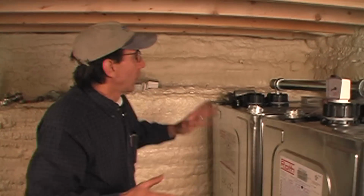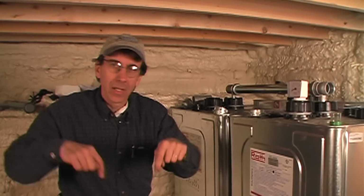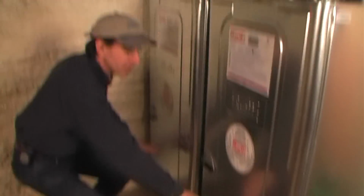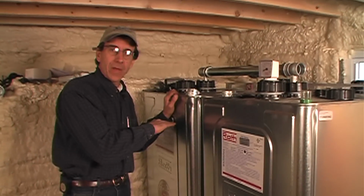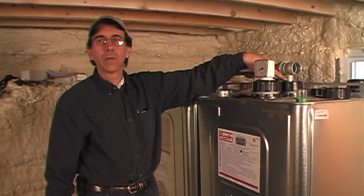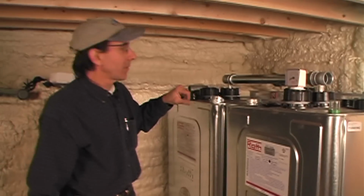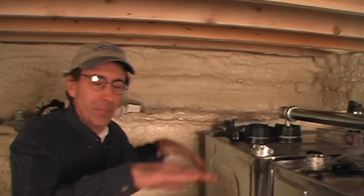Now, with this pressurized, with oil coming in at 40 gallons per minute, it hits those little orifices, and the same amount of oil comes out of both of them at the same time. So the two tanks fill up equally. And what happens if for some reason one tank fills up faster than the other tank? It stops here and it all comes out here. Pretty cool. And this is under no more pressure because it has the vent, and if it came up on the back side by the vent, it'll just go over because everything is in parallel.